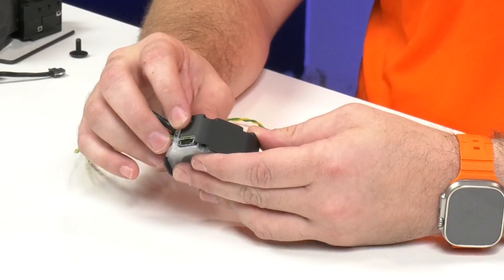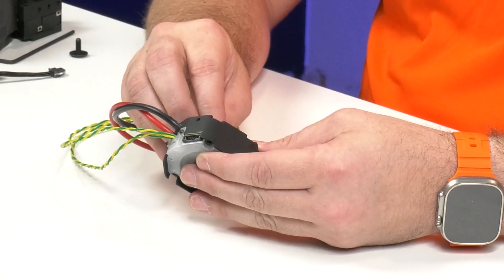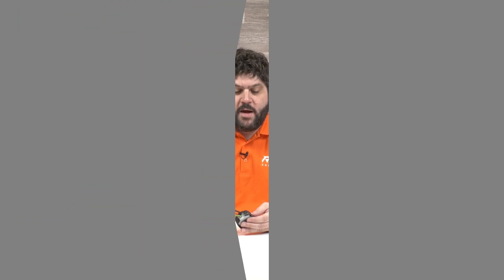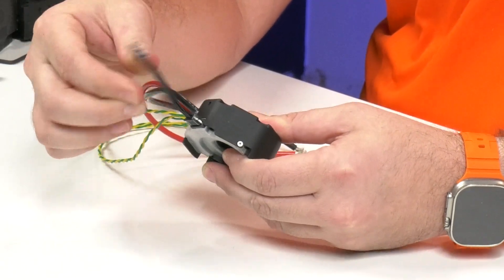The last thing I want to highlight here is our new and improved data port. We know that people love the data port on the Spark Max because you have direct access to things like limit switches, encoders, or external sensors. We have all of that covered on this one, but we're also adding the ability to communicate through some additional external interfaces on this data port connector that will become available with a future update. With the enhanced data port and the additional functionality we've added, we've also changed the connector to a brand new locking style connector so that you don't have to worry about anything coming unplugged during a match.